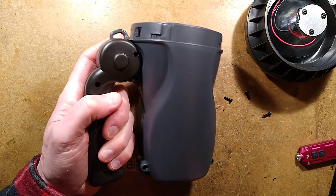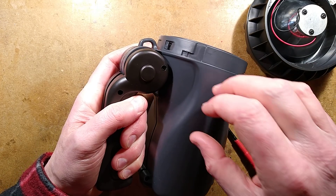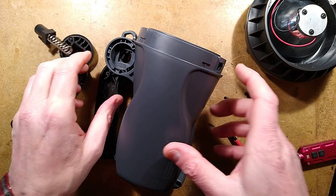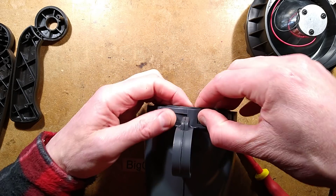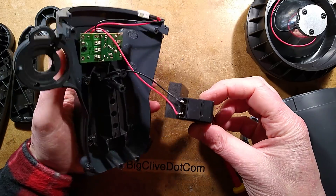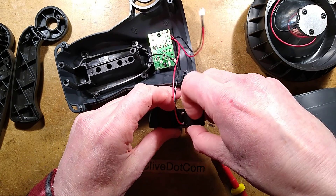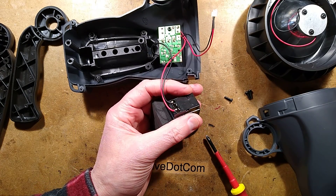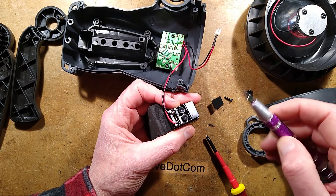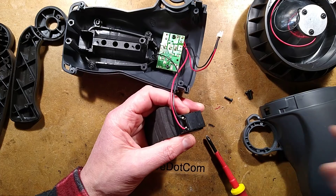They're fairly valid as battery technology but they often abuse them. Oh, this has got a spring in it — it's feeling very springy. Yes, it's going apart now — there's our battery. So how many cells is this? Let's pop the cover here. Usually they've got little filling ports. This is a two-cell battery, so it's roughly rated at about four volts, which kind of fits for an LED and also for charging it from a USB.